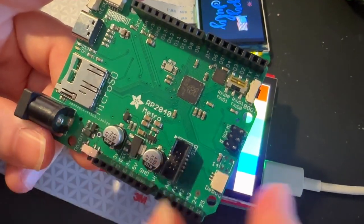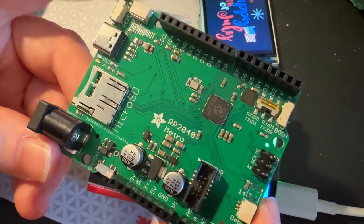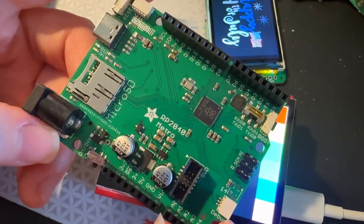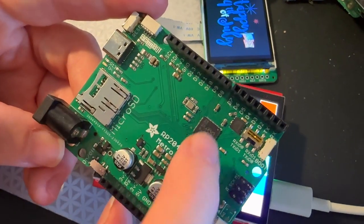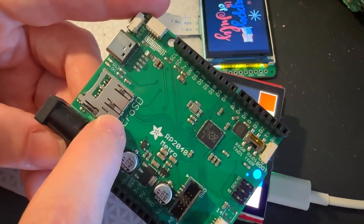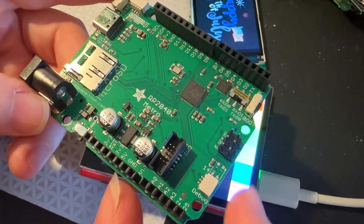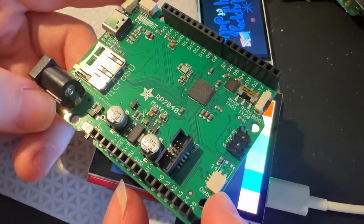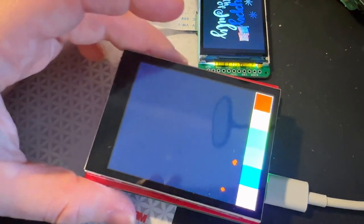What's this? This is an RP2040 Metro board — kind of what it says it is. It's an Arduino classic-shaped board with all the header pins, an RP2040, all the GPIO, and a micro SD card hooked up for SDIO if you want high-speed reading. There's a NeoPixel to solder in, a debug port SWD — all the ports and everything.